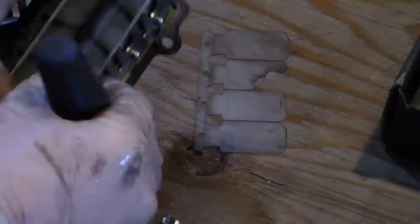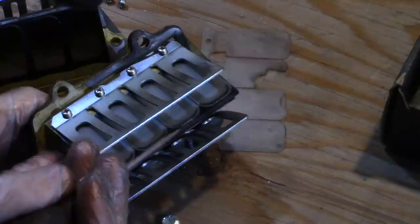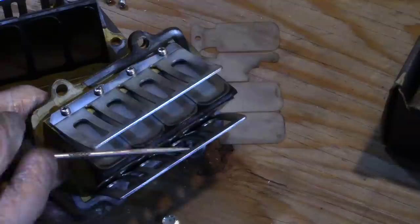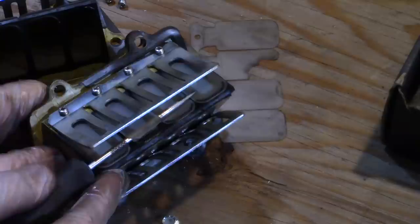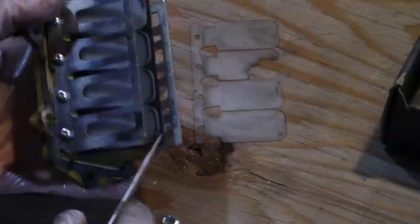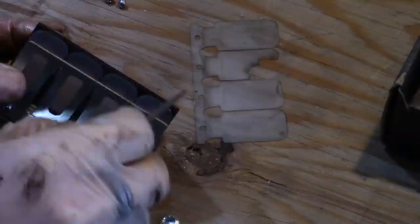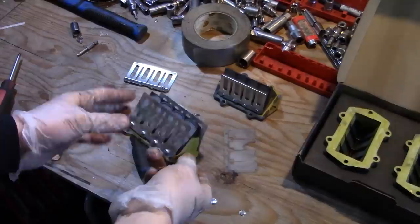Let's look at this other cage here. You can see that on all the edges of all these valves they're one foot out the door. There's a bunch of wear here, bunch over here. This one is a good example because this is how they start - this is how they start to wear. You can see right there that the end of that petal is getting a little beat up. So that's what they kind of look like when they start to go. These ones are one foot out the door, they're on their way out. The other side, the PTO side - that's the one we had the problem with. They're starting to get chipped just from actuating so much.